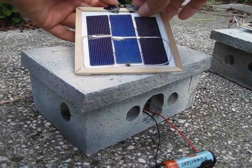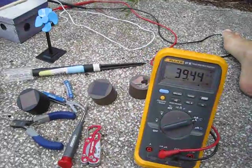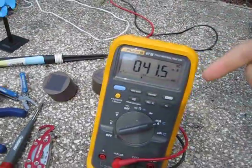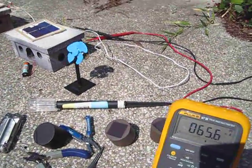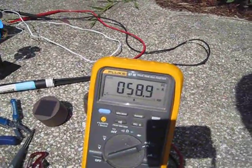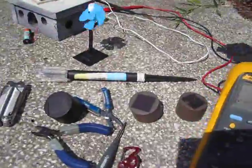This is the shared line, and all these houses are strung up in series. We got a cloud that just went over so the output here just went down underneath 60 milliamps. Once the fan hits about 70 milliamps or so, that fan will get going again. The fan needs at least about 60 milliamps once it gets going — so that's the minimum output for this fan.